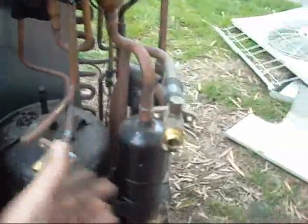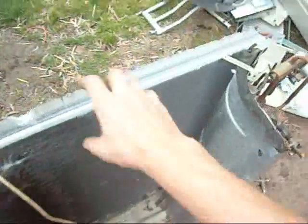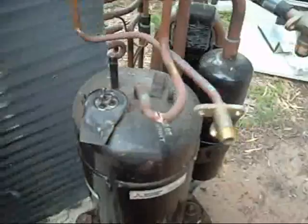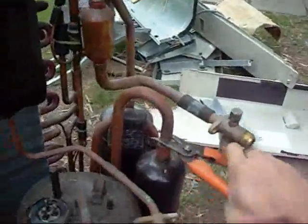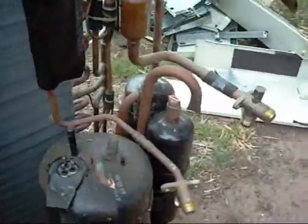There's a valve bracket there. Slowly getting there — pull the top fan bracket off and pull the fan forwards and it rips the screws out of the base, no need to waste time pulling them out. Unscrewed and unhooked. The coil's just sitting there now. Get the old snippies out. Compressor discharge is gone, compressor suction is gone.